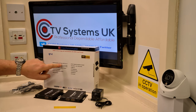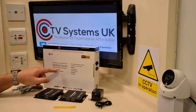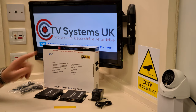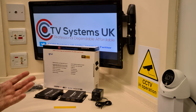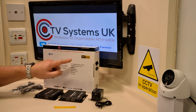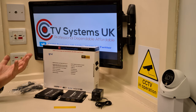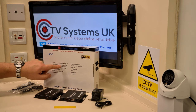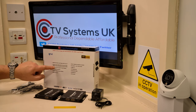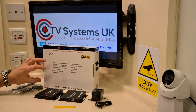There are 12 bullet points on the back. The key one: it's an HDMI extender over single Cat 6, Cat 6a, or Cat 7 cable. That's important — at no point does it say Cat 5. As I mentioned in the previous video, you can use Cat 5 full copper, easily identified because it's the full 350 MHz stuff with really good speeds. But not with this, because of the 4K content — you need Cat 6 up. Distances: 4K at 30 Hz up to 55 meters, 4K at 60 Hz up to 35 meters.